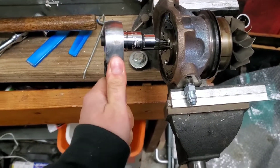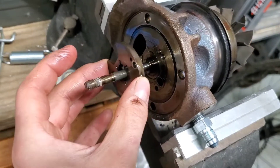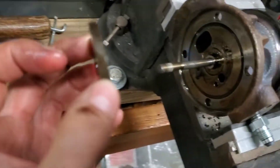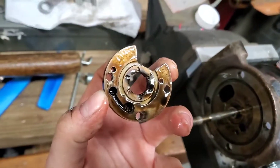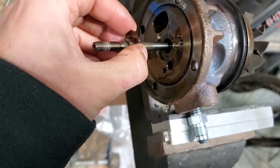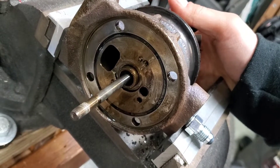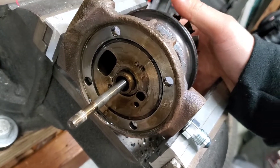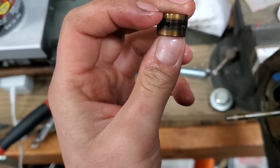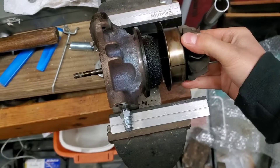This one has three screws, so I'll get my ratchet for these small screws and loosen those up. Luckily you don't have to worry about lining this up later — it's got a little pin that holds it. Just make sure your orientation is correct. The groove is pointing toward this pocket for oil so that you constantly have flow through here. After taking off the thrust bearing, you have a little bearing spacer between that and the main bearing. Pull the shaft back slightly and press this out gently — don't do any sudden movements.